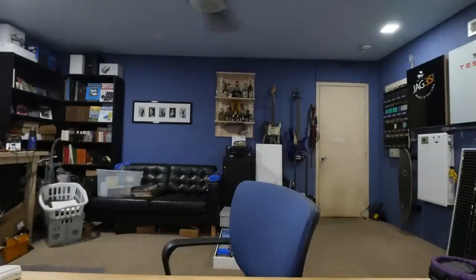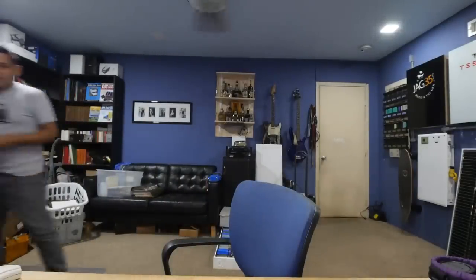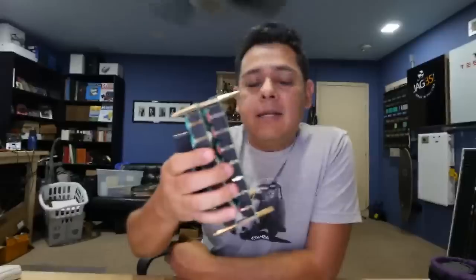Let's see. I have this to compare it to, right? Because this has a feature that auto balances a pack, right? So this will be able to auto balance our little packs like this. We'll be able to measure how fast. I'll do it simple, like these are 1.5 or 1500 milliamp hour cells, and then I'll do like a full one, and then one at 50% state of charge, and then the next one full, and next 50% state of charge, and then I'll plug that in there, and then time lapse it, see how long it takes for it to actually balance the thing.